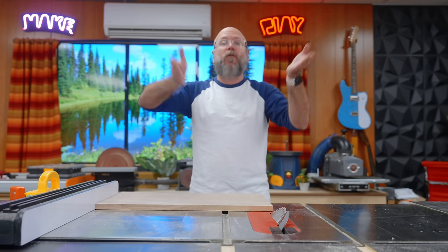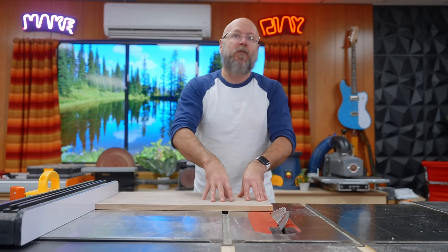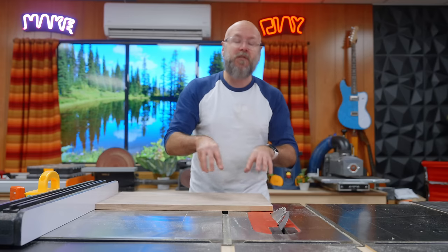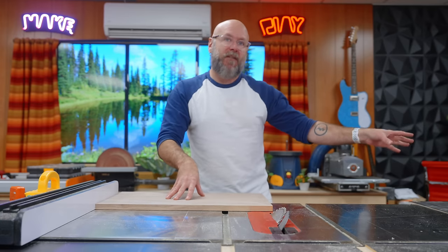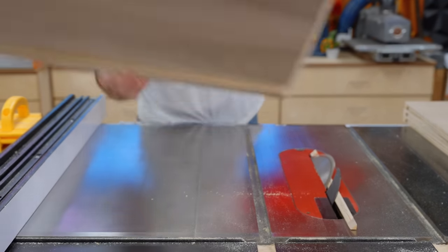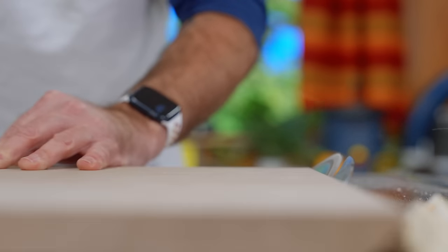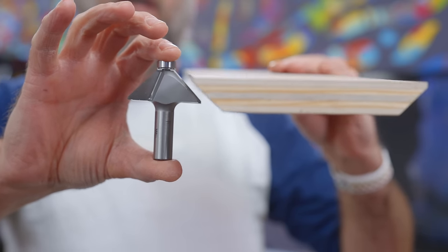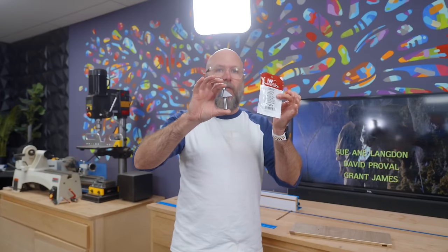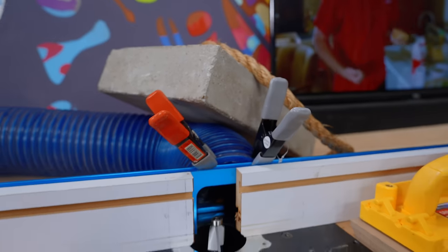The carcass for each nightstand is going to have 45-degree miters. Typically I do this at the table saw, but Stumpy Nubs has convinced me to do it at the router for greater accuracy and a better chance of success. So I'm going to do that with a chamfer bit, but I'll hog away most of the material at the table saw first because I don't have the best dust collection set up for my router yet. The chamfer bit needs to be at least the thickness of your board. This is a Whiteside chamfer bit with a cutting height of three-quarters of an inch — definitely my biggest chamfer bit.